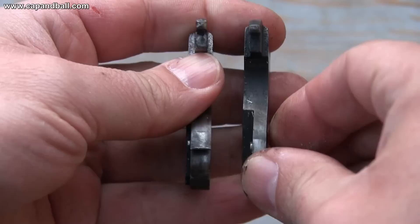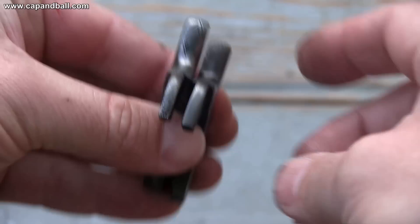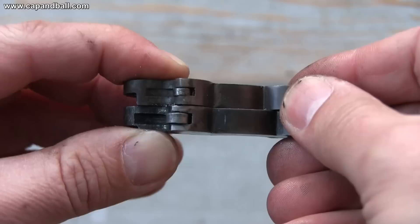And here are the hammers with a lot of minor differences. The tumbler part of the new model on the right is thinner to fit the sear. The shape of the comb is also different — the Beals is higher and it was formed manually. The shape, size, and angle differentiate the two models easily. The size of the rollers resting on the mainspring is also different; the new model has a much smaller one.